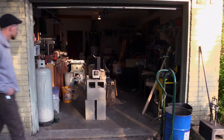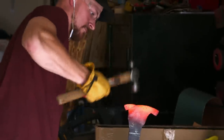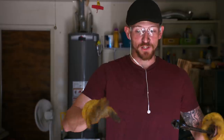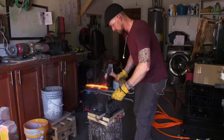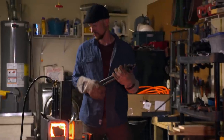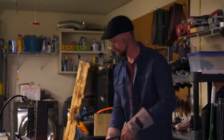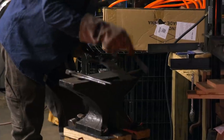It's the morning of day three. It's going okay, considering the fact I had to restart yesterday. Hopefully just finish drawing out the little head, and then start drawing out the big head. I've got a small axe head — I'm happy with that. I've got to finish shaping it, and then move on to the big one. I'm actually kind of happy it fell apart at this point. It's coming out a lot better, working a lot better. I think it was meant to be. I've almost got the shape of my head, so I'm going to stick it in the forge, heat it up, and then we're going to go for a quench. Big side first. Now we're about to quench the smaller part.